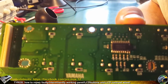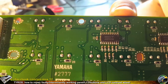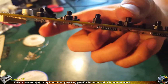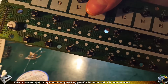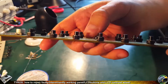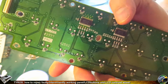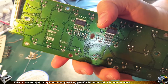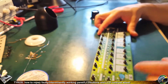And final inspection done. Yeah, properly, no residue, no bad quality joints. Yeah, it's straight, so it lays down on the PCB. Job done. This through-hole micro switch does not require extra cleaning, unlike the previously shown SMD micro switches, which have been soldered into the LCD. So now let's put back all bolts into the keyboard and check if all repairs have been successful.